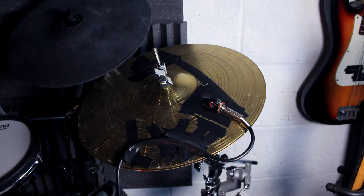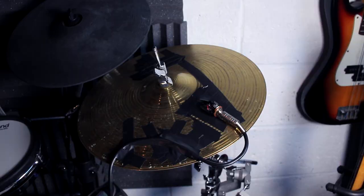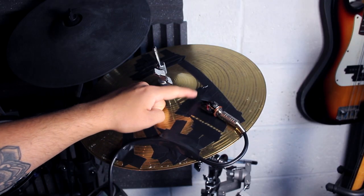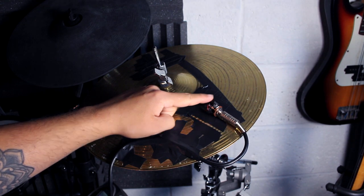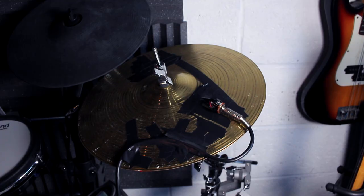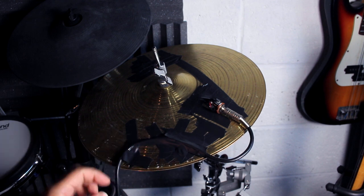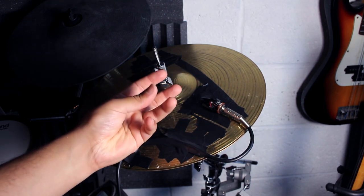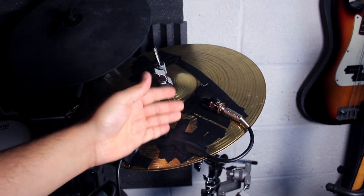I've put my cymbal on a hi-hat so there'd be less vibrations and less movement, so the trigger doesn't re-trigger easily. One thing I'd recommend is before you put the piezo on the cymbal, put some padding between it — even just a couple layers of tape, a bit of tissue, or even moon gel. That'll reduce the vibrations after you initially hit the cymbal and again reduce re-triggering. I also left a lot of slack in the cable and the wires so that if it moves about it won't pull apart — especially with the instrument cable dangling down, you don't want that pulling down on the trigger.